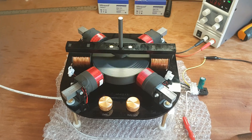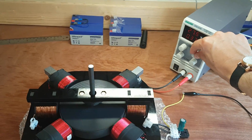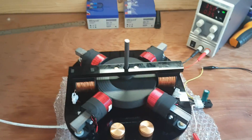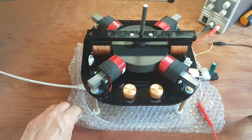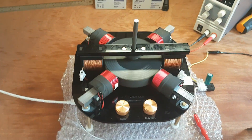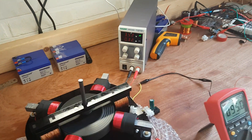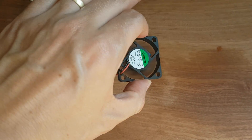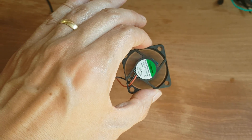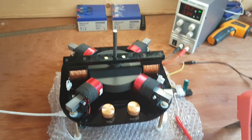Let's see how we can change this. We could get more out if we increase the voltage. At 35 volts it's speeding up — I'm still having vibration issues, which is why it's sitting on these bubble things. I have some rubber on order so hopefully that will help. Now we're at 1200 RPM, but I had to increase the voltage significantly, and now we're drawing 95 milliamps. The fan is spinning pretty fast but the performance is still not amazing.